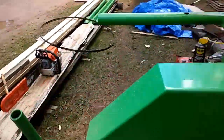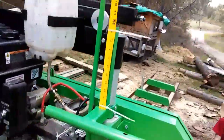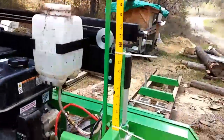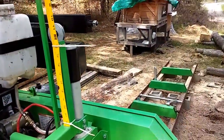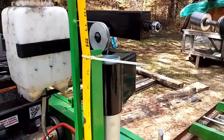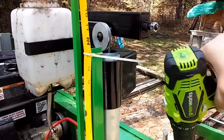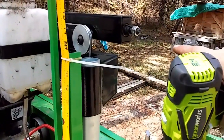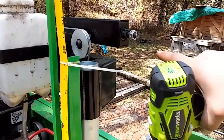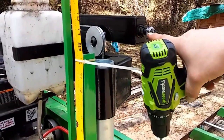This is pretty sweet — I found this idea online, it was actually another guy's idea, but it's still pretty sweet: manual up and down. It has a roll pin that holds it on the original handle, so I took it off, drilled a hole in the bolt that slipped over the shaft, and put the roll pin back in.